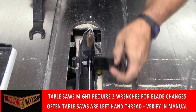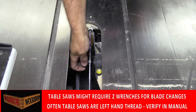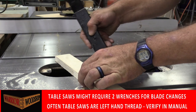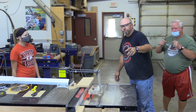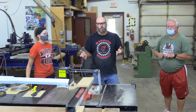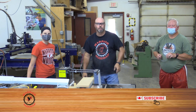Most of the time in shop class you will not be changing the blade. However, at home your saw may require two wrenches or just one — consult your manual. If it only requires one, you will need a block to stabilize the blade while you loosen the arbor nut. Also be aware that some saws might be left-handed threaded, and they'll loosen the opposite way of righty-tighty. There are a couple of extra videos on how to cross cut with a table saw and one that involves kickback and how the saw stop works. If you're in one of my woodworking classes, you're probably assigned to watch them anyway. Thanks for watching — if you liked the video, be sure to like, subscribe, and hit that bell. Go make some sawdust.